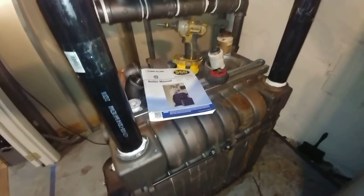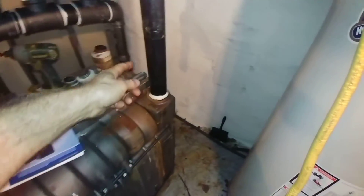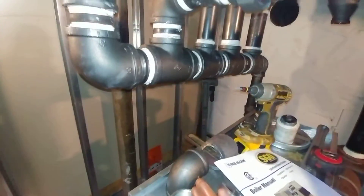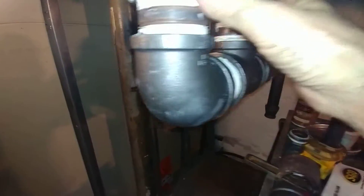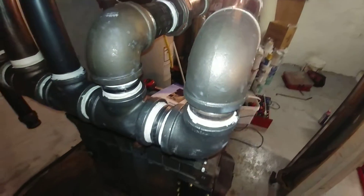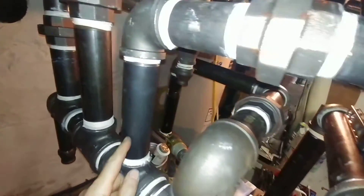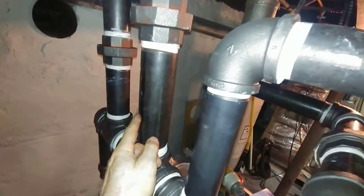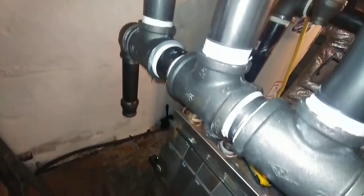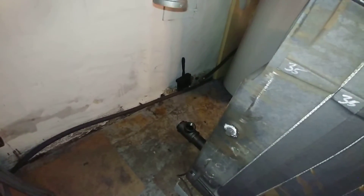In this size boiler, the manufacturer calls for both two-and-a-half-inch outlets to be used and to be installed on a three-inch header. We've brought the two outlets a little closer than I would normally like, but we had space considerations because we had three takeoffs — one of which was two-inch, one was two-and-a-half, and one was two-and-a-half — and then the beginning of the equalizer line, which is hopefully going to be installed today.